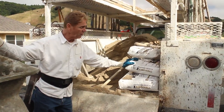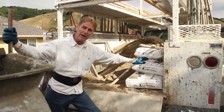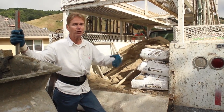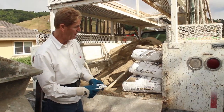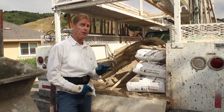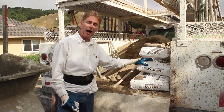And we're using Eisenwall. What is Eisenwall? They sell this at the material yards. You're not going to find Eisenwall at any of the hardware stores. Why? Because you used to need a certification to purchase it, which I had about 15 years ago. Eisenwall is a white cement, just like Lehigh Hanson makes a white cement. But this Eisenwall is designed for bridges. Rapid Set makes Eisenwall.